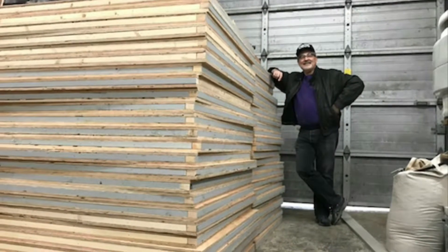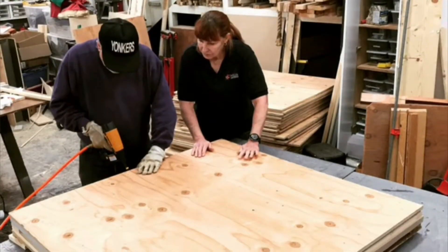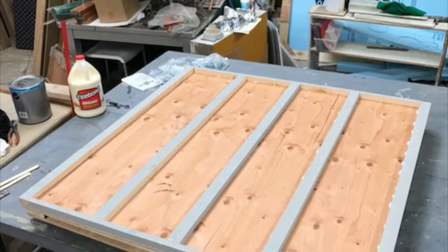This is our new platforming system known as Triscuits. This design was created at the Yale Drama School in the 90s. A Triscuit is what is known as a stress skin platform. It's made of three layers — hence the name — consisting of two plywood skins with internal ribs to provide strength.